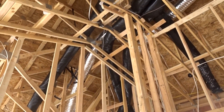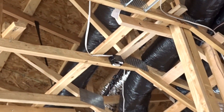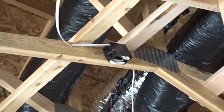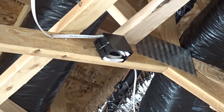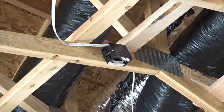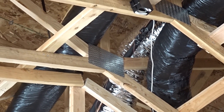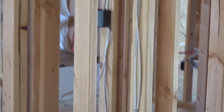What I wanted to focus on today is the makeup of three-ways, dead ends, and smoke detectors - where you need these when you wire your own home. Smoke detectors: you have to have one in every bedroom, and they like it within three feet of the door.